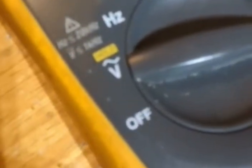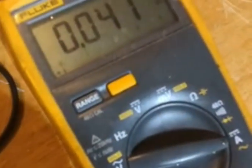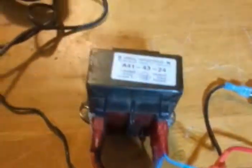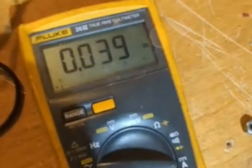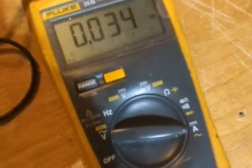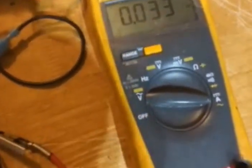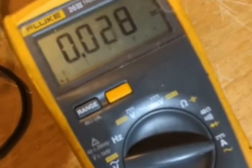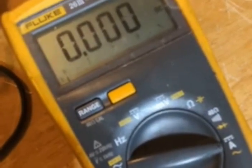We're at about 40 volts. I don't think I can get it up to 50 volts — yeah, about 44 to 45 volts. I don't want to pump this up too much. As you see, we're going into there — and now, look, we have current going through the multimeter. Where is this current coming from? It's not coming from the supply side. Because as we saw with the resistor, it doesn't have a path. But there's current going through it — I could light LEDs with it, I could fill caps. It's real current. I just showed you in the picture tutorial where it's coming from. Now I'm going to turn down the power — turning the variac down slowly — and the power is starting to vanish. And it's off.